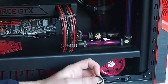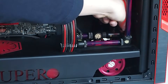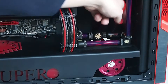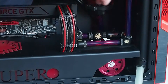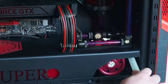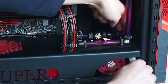The tap has a female one-quarter inlet inside to which this fitting can screw in. Because it's a tight corner, you screw the fitting into the water tap first. You don't need to put a lot of pressure on it — just minor tight and it will be water tight. Then you grab the hose with the fitting, turn the tap which is revolvable so it won't leak, stick it through the hole, and attach the fitting into the 90 degree angle.